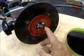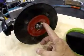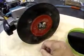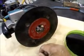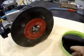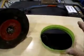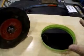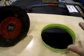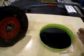The bearing is actually 2 thou under 3/4, and I measured across here with the mic and I got exactly 1.25 inches. So if anything it'll cut a little deep, but with this tape here it's going to keep it from doing that. I can try, just to make sure nothing wild happens. If I'm a little bit small still, I'll pull the tape out and give it a try.